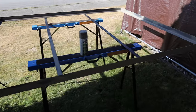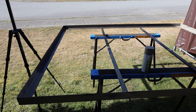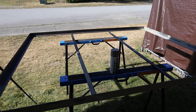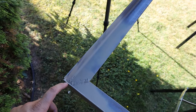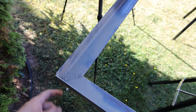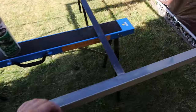You can see I've got my frame made. I did see a guy use cattle fencing for the middle which would be great, but unfortunately there's a port strike in Vancouver right now so they can't get it in. Instead we're going with two cross rails taken from another bed frame and quarter inch plywood. The rails are 75 inches for my wall height and the end ones are 50 inches. I used an angle grinder and cut on a 45 at all corners, then welded the bottom, top, and back on all four sides. I also took an old bed rail and welded it to the bottom on either end for the middle supports.